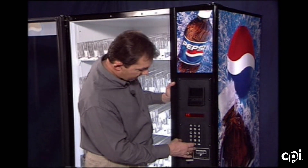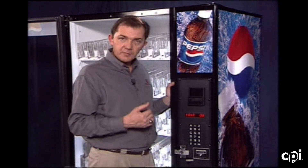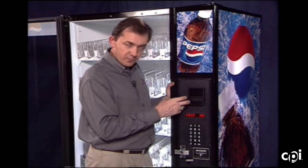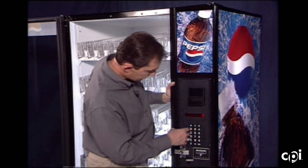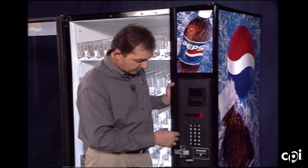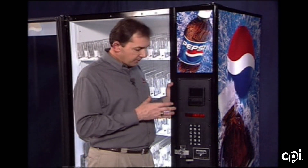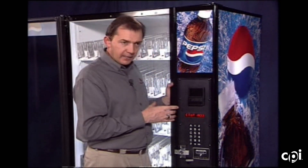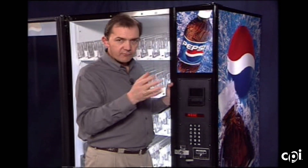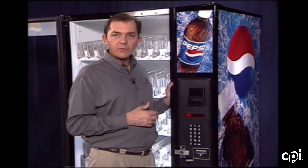Set not available time works the same way — enter in, set start and end hours and minutes. Winner mode: initiating this by pressing star sets the machine into a winner mode where, at a random time based on a set number of vends, it will vend a free drink. It's not item-specific — any one of all 45 selections could be the free one. We enter in the number — for example, on the 200th vend, it will give away a free drink.